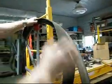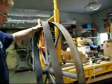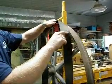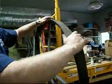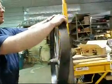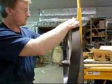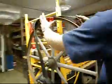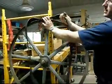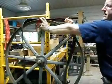Now again, when we're stretching these tires on, instead of stretching the entire tire and fighting all of this, we're really trying to focus our stretching in one area. This will be easier to do, and you'll be able to follow it all the way around. And being a little bit of a contortionist, you'll be able to get it without having to call your neighbor over to help you. So starting out, just like we did before with the two-man tug-of-war, I'm going to put my hand against this first part, and I'll focus all my stretching up on top.